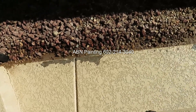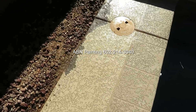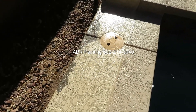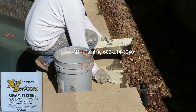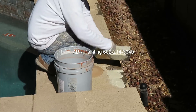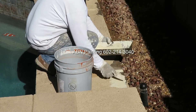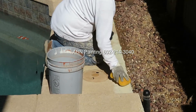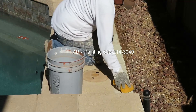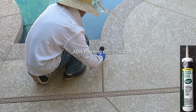There are a few areas on the edges of the pool deck where the concrete is chipped off, and we're going to repair those areas prior to painting. We're using Excel texture that we apply with a putty knife, and then using a wet sponge we blend it in. There are also a few cracks in between the concrete slabs and we're going to repair those using a concrete filler.